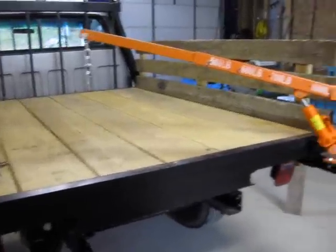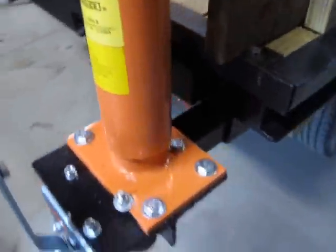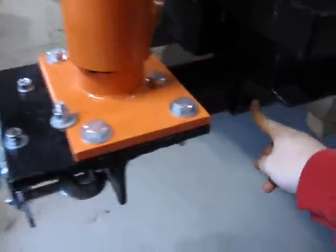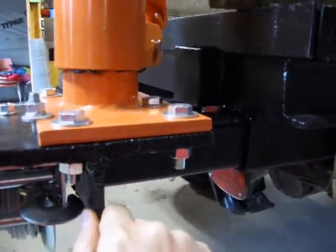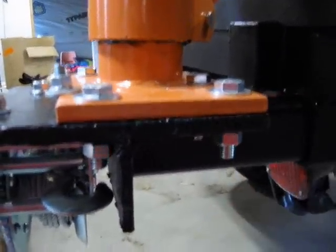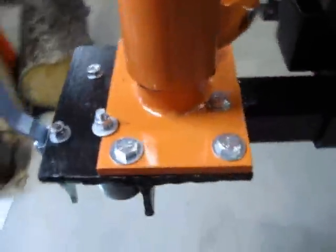This is the truck crane — I've installed it. What I've done is used some scrap iron to build a mount. It's got a receiver hitch that's reinforced under the truck, and then this slides into it. Welded onto it is this piece of an I-beam. It's half an inch thick, very rugged. The crane bolts to that with five bolts.